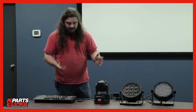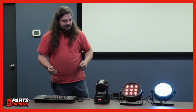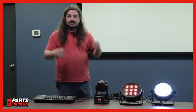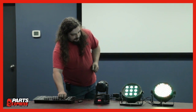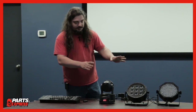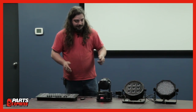I don't have one of those here, so when the board is off, maybe they will. Yeah, like that. So the board's off, they start producing light, but it's chaotic, lets you know something's gone wrong, you need to fix it, but at least you can see in the stage or what have you has not gone completely dark. So that's a good idea to power the board on. Don't mess with anything. Let it come up and make sure everything's black. Nothing is freaking out. Nothing's wigging out. Now we're good. Now we can program.